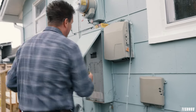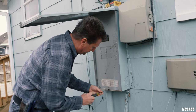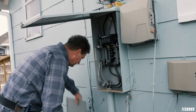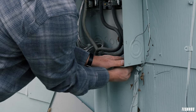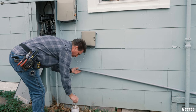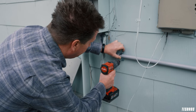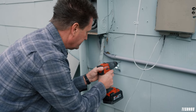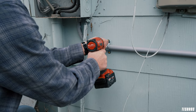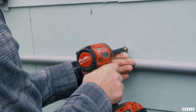The first step is to open up your panel. One trick: you pull it and push it down so it stays up. It's typically just a couple of screws. Once open, you can see everything inside. At the bottom there are circular knockouts you can punch out and fit a bracket to hold the conduit. We are using plastic PVC conduit because we're installing outside — it expands and contracts easily. Use PVC glue to set the L-shaped pipe, and use brackets that aren't super tight to allow for expansion and contraction. It's a three-quarter-inch pipe, so pre-drill to avoid shattering it.